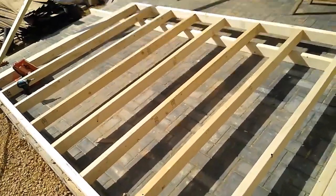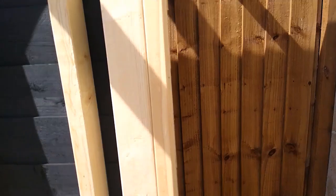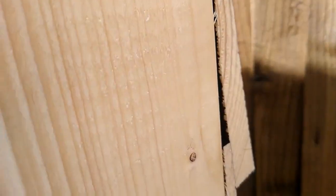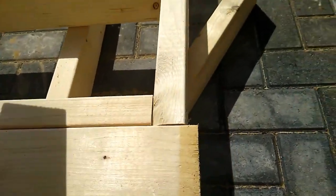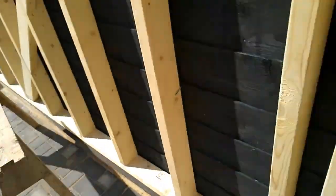This panel is complete. Now because I'm butting this panel up to this one here, this is basically what the panels are going to be. This piece of timber here — the cladding has got to work its way all the way to the end. So what I've done to mimic this piece here is screw a piece on the end, then I'll bring my boarding out to the end like that and that will just sit over and lap to this corner.